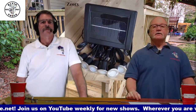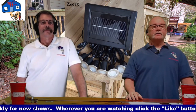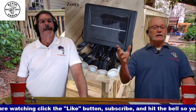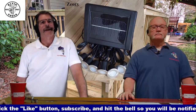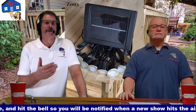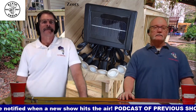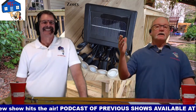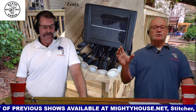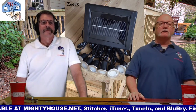You might want to use a kit like this — you get a solar panel, it's got a built-in battery system, and you're back to wires again, but you don't have a transformer. It'll go dawn to dusk and automatically turn on and turn off for you. That's going to be more money, but to me that's still the better way to go because it's going to have a single larger battery — and if you've got to replace it, you just got the one. The LED bulbs in those lamps last a long time, the solar panel lasts a long time. It just always comes down to battery technology. They make these in spotlights and all kinds of stuff, and a lot of those larger ones have the same kind of battery you'd find in your alarm panel — you can pick those up at your hardware store.